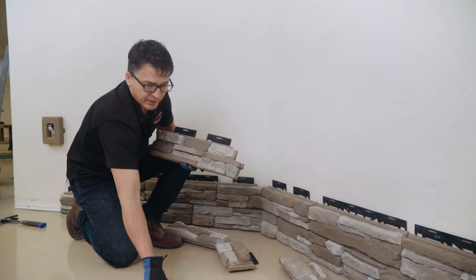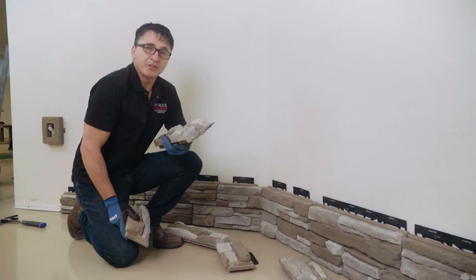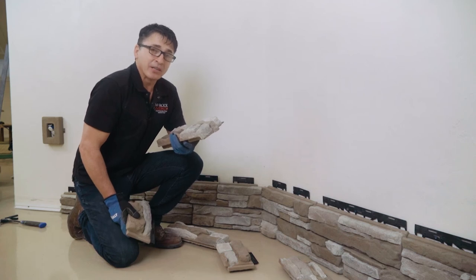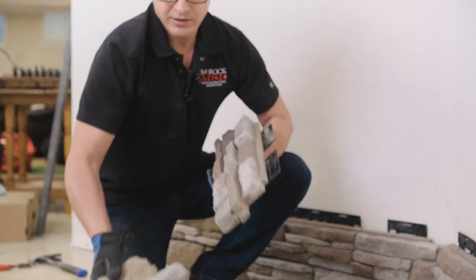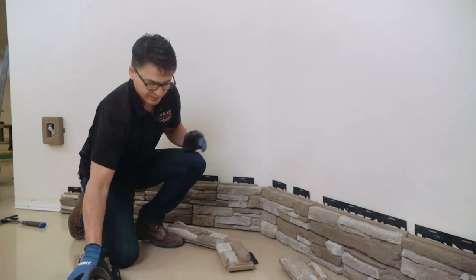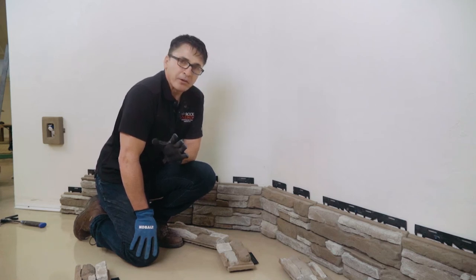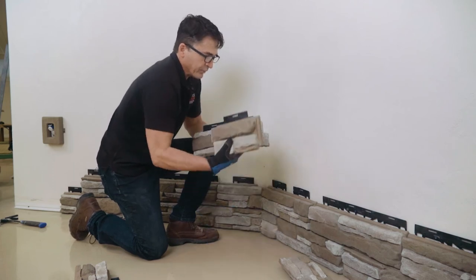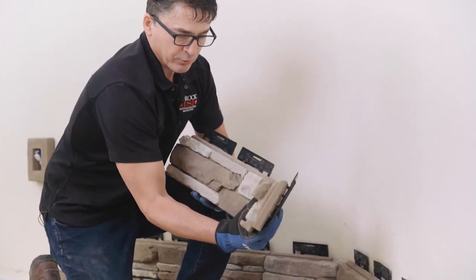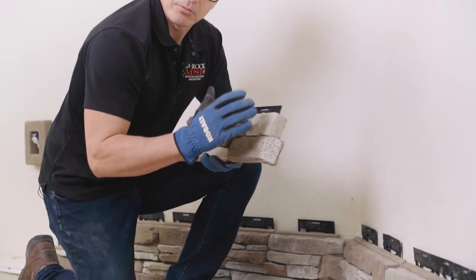MROC p-series cornerstones are two pieces that come out of the box ready to be matched up. It's very important to match them up when you take them out — keep them together and don't just unstack 10 boxes of corners and set them everywhere. For this project we've already cut the 45-degree angle using a small compound miter saw set at 45 degrees. All we've done with the cornerstones is cut the short side of the stone at two different angles to get the 45-degree cut.